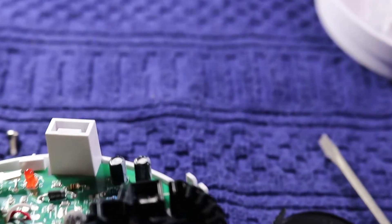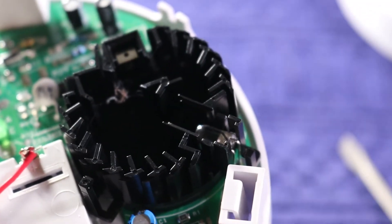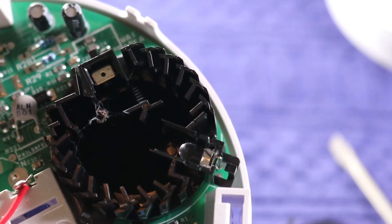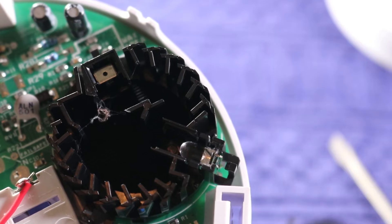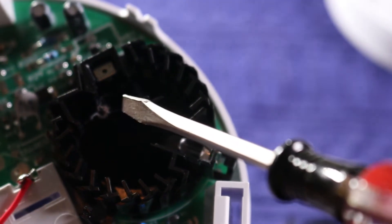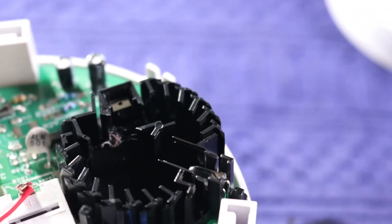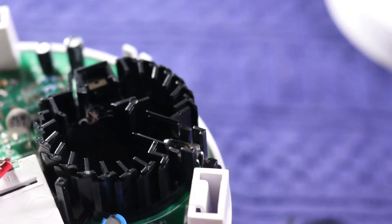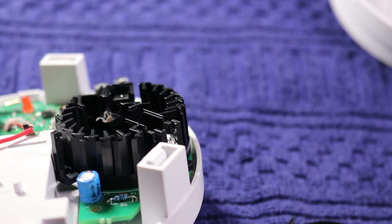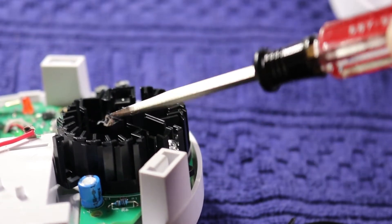Zooming in, we can see there is a spider and some spider webbing — that's what we need to get rid of. You can also see that the emitter is at the bottom of the photoelectric unit and the receiver is at the top, next to the tip of the screwdriver. The spider web is in between both, which means the light path is broken and that triggers the alarm. This is completely different from an ionization unit, which follows different principles of operation.